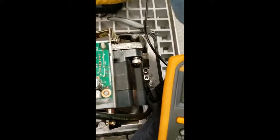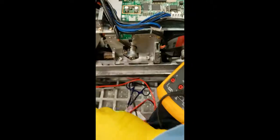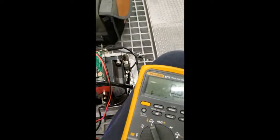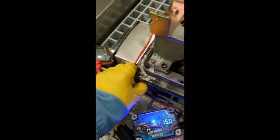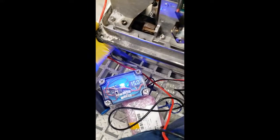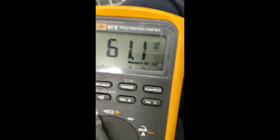But here's the thing. If we put our leads back on the signal wires and we grab our test box — there's a portable power supply, any type will work. We got our power supply hooked up, we got nothing touching. We turn our meter back to millivolts and we turn this on. We're putting out 15 volts. We're reading 60 millivolts. Now understand the output should be about 6 millivolts. I can also push here with my finger on the bottom. We can see that it will kind of respond to that. But we can tell when we hook up the power supply that it's putting out 10 times the amount of voltage that it normally should. So we know that the load cell is bad.